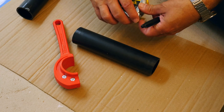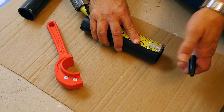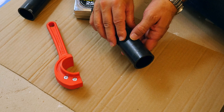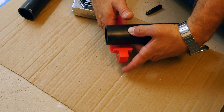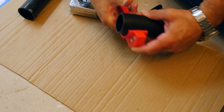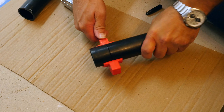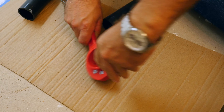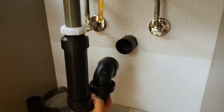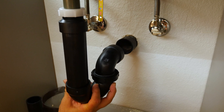Let's cut off that excess. Get your marker and tape measure — we're going to go one and a half inches. There's our one and a half, there's our center. Push it on and twist it. Now we'll check our fit. We're going to check to see if we line up with the old tailpipe coming out of the wall, and it's perfect now. We have what we need, and now we're going to start gluing it together.